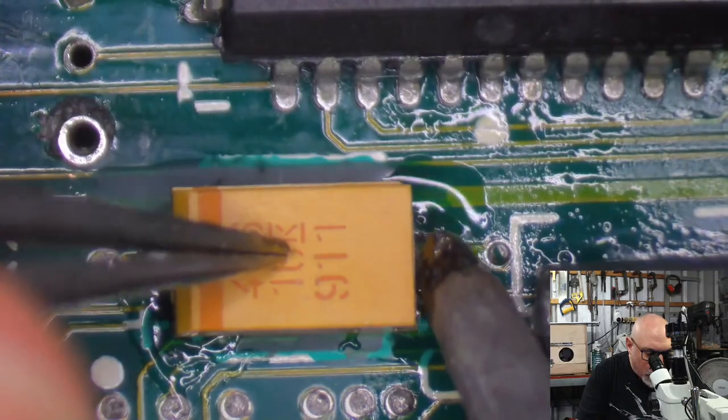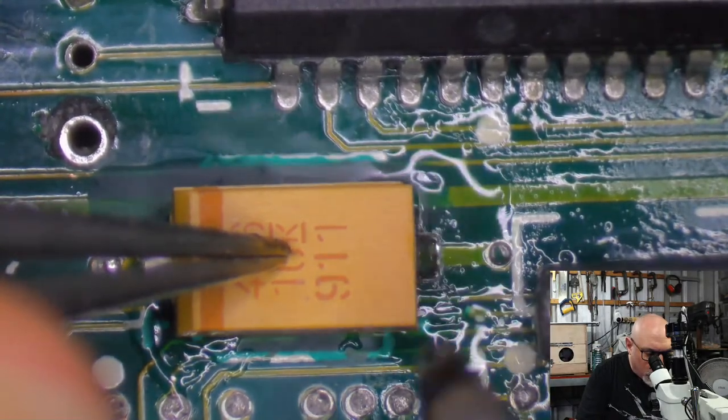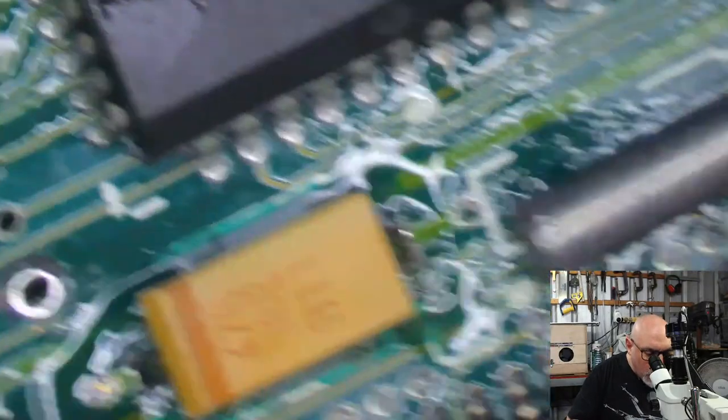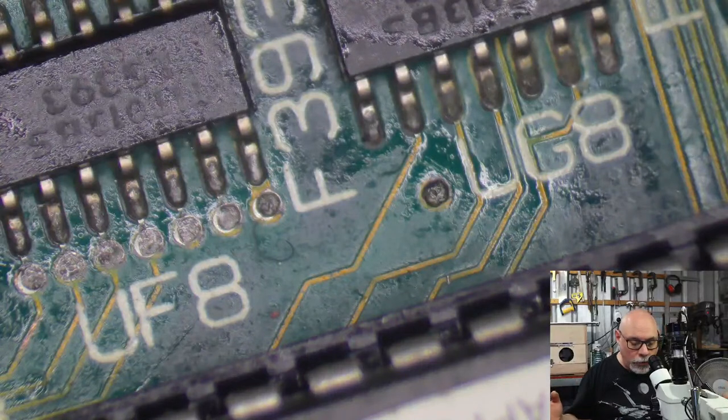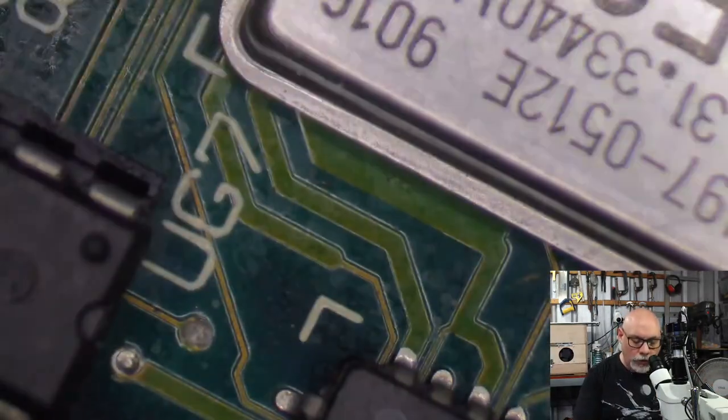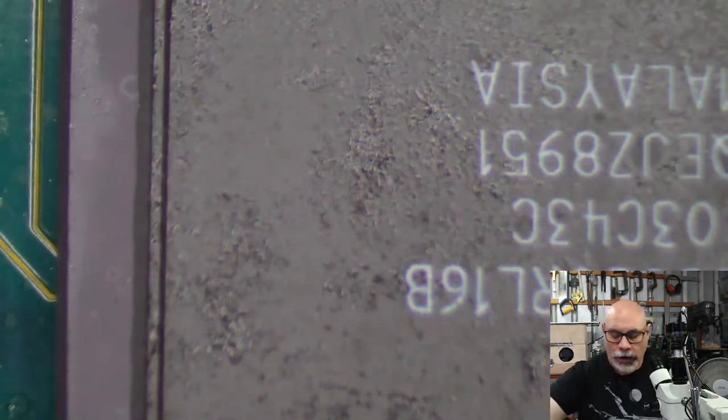Generally see posts about it a lot on Facebook, you know, people with SE30s going, oh, I'm having problems with the video, what's the cause? And of course, if the board hasn't been recapped, then recap it before you do anything. Are the caps 100% the cause of your problems? Not necessarily, but there's no point in trying to diagnose other problems when it's still got old leaky caps on it. You replace the caps first, see how it goes. If you've still got problems, then you move on to the next step in diagnostics. But you've got to recap it first. Simple as that.